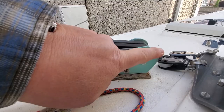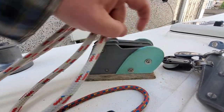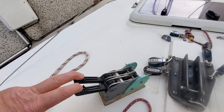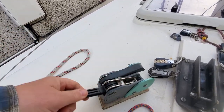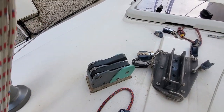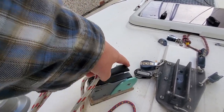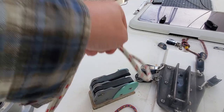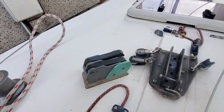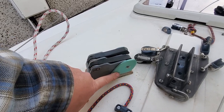Now these are fitted, you can see there's a nice smooth curve going along there and there's nothing for the rope to catch on, but I can still operate both of the clutches as intended. And if we get a bit of rope and try to catch that — even if this one is slightly open — it can't catch it. I'm more than happy with that. What I need to do now is figure out a local engineering firm to make this in stainless steel.